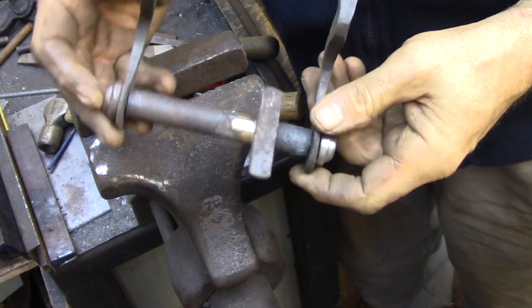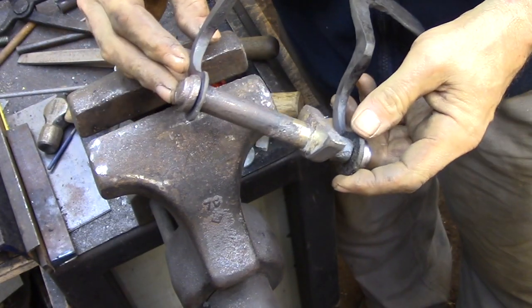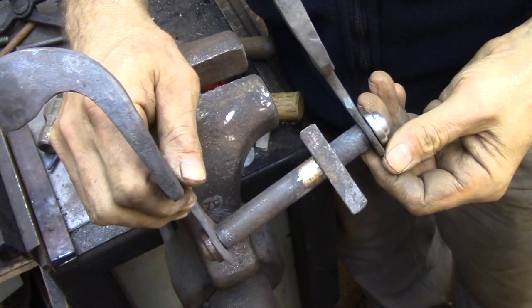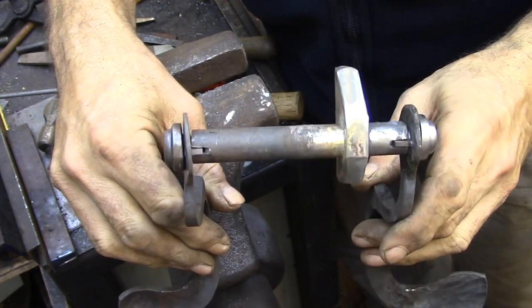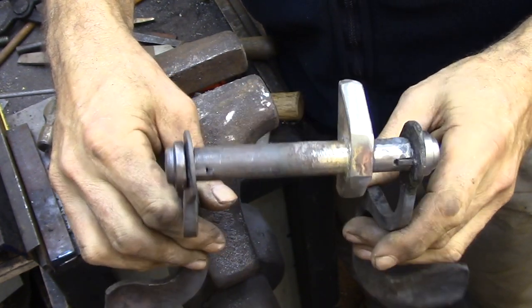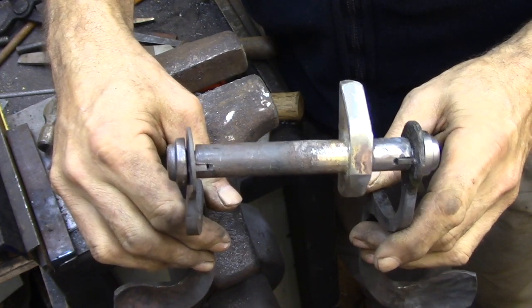Here's the whole thing assembled — both handles are locked to the center pipe so they work as a unit, and that lifts the lifting cam that'll eventually lift the latch bar so that you can open the door. On the underside you can see the keyways that I've cut. There's still some filing that needs to be done, but that'll all be done as part of the final assembly and finish.